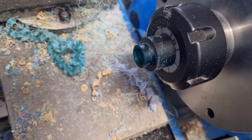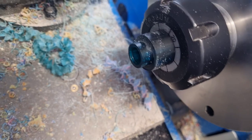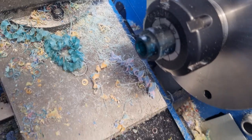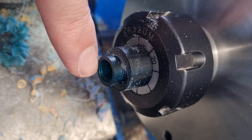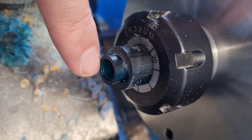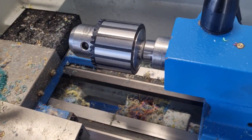This is my process for doing the section taps or section threads. I've pre-drilled it with about a 9mm bit, then done a tiny little recess here with a 10mm bit, going in a millimeter or two — that's probably gone a little bit too far on this one. Then I'll use my Jacob's chuck for it.